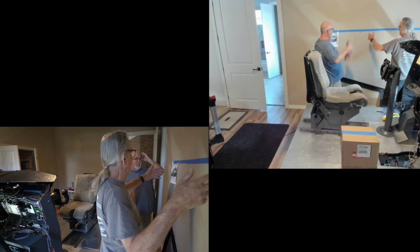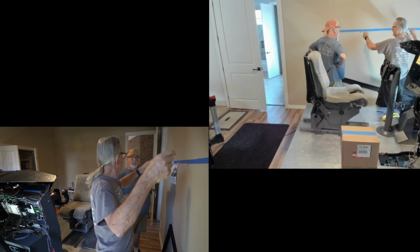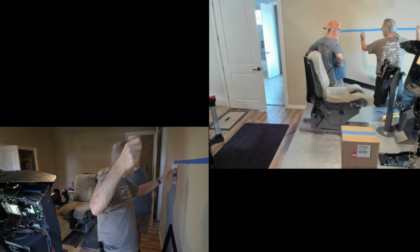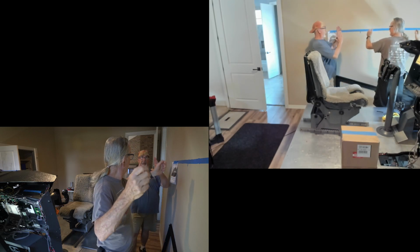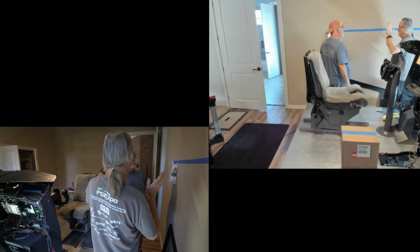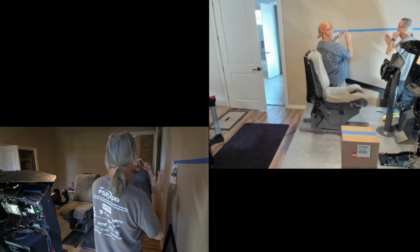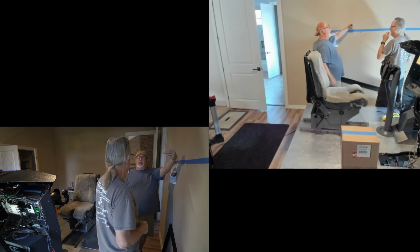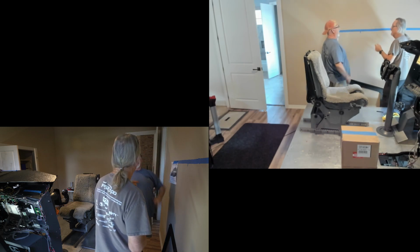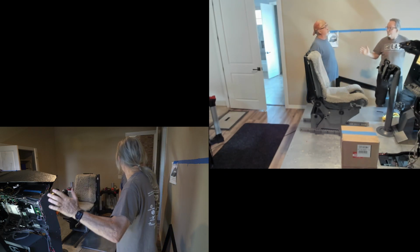So I need to get a bracket that can not only support the weight as it cantilevers out, but can also tilt and slightly swivel, without a lot of force. Mine had a tightening bolt on the back. So you loosen it up a little bit, set it where you want it, then tighten it down and it just stays right there. And that's important because you don't want these things moving.